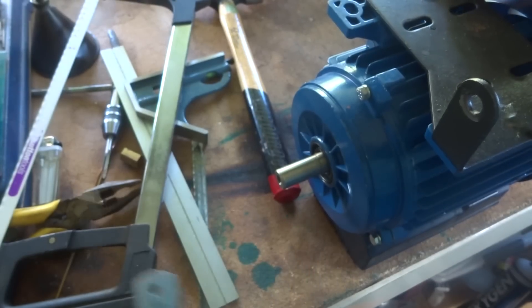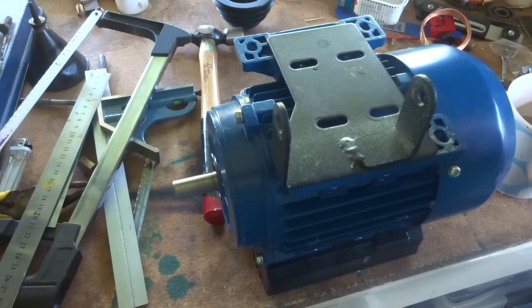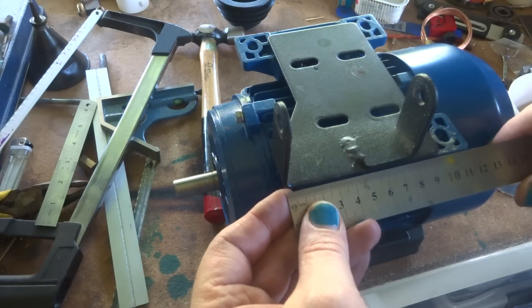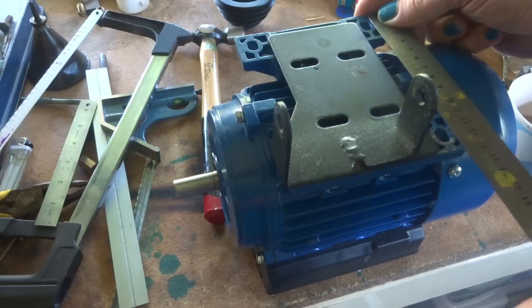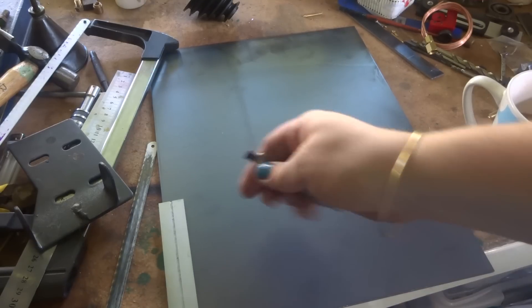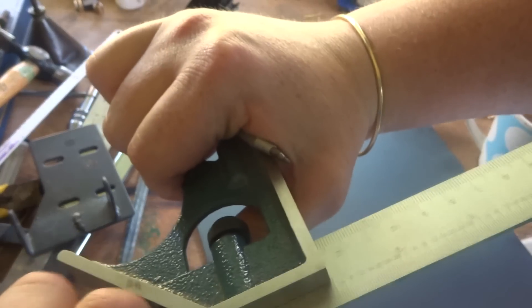It wants to be about there. And as you can see, only one of the bolt holes actually lines up. If we measure this here, we want a piece of plate to cover this mounting face — we want a piece of plate 120 by about 140, I reckon that'd be good. We'll set it at 140, mark there, and set it here at 120 and mark the other way.